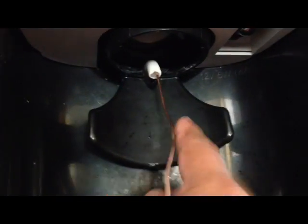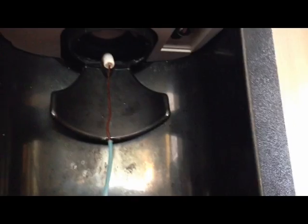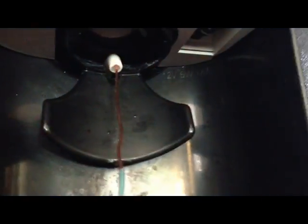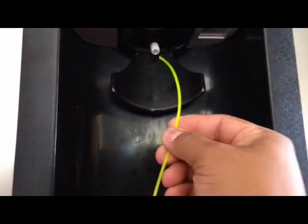What I did here is I got a copper wire and I fed the copper wire in. I'm using number 12 wire, but I recommend number 14 copper wire because it's a lot easier to bend. I heat the copper with a heat gun and push it in and out, then heat it again and keep pushing it in and out while heating it, and it'll break up the ice in there.